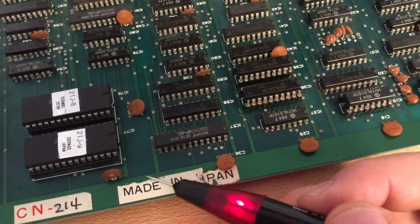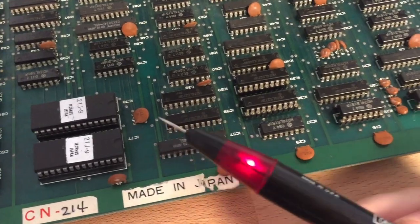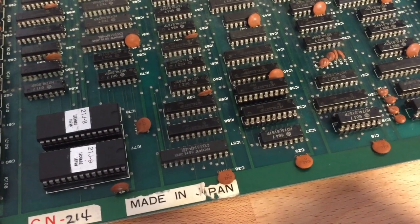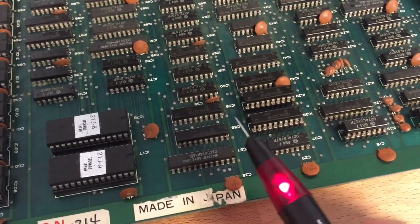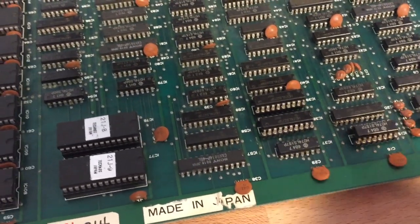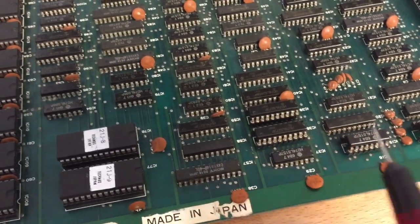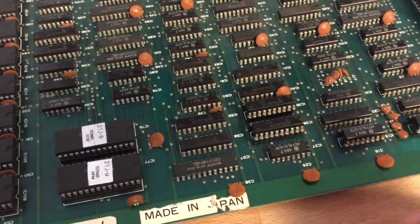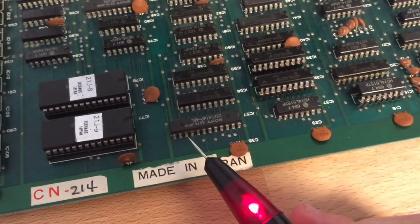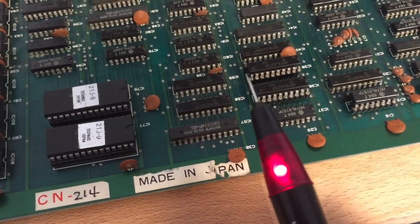I don't know if that is meant to be really, because maybe if you would generate a set of tiles, the first tile you would have in your collection would maybe be just one black tile. So if you wanted to fill the screen with a completely black background, you would use that first tile. It would be pretty obvious. So it could be that this line is actually stuck high, and to find out if that is the case, we